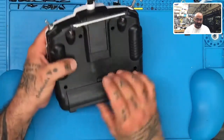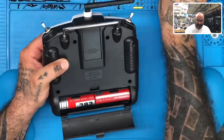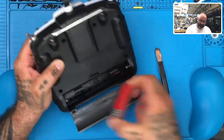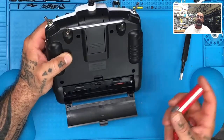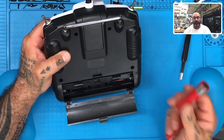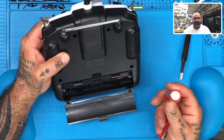Now if you've taken the radio out already and opened up the back you're going to notice that it takes two 18650 batteries. The 18650 battery is a lithium ion battery whereas your drones are usually going to run LiPo batteries or lithium polymer batteries. These batteries can go pretty low before they get damaged, whereas lithium polymer if you take it below about 3 volts or 3.3 volts, you're probably not going to get them to come back.